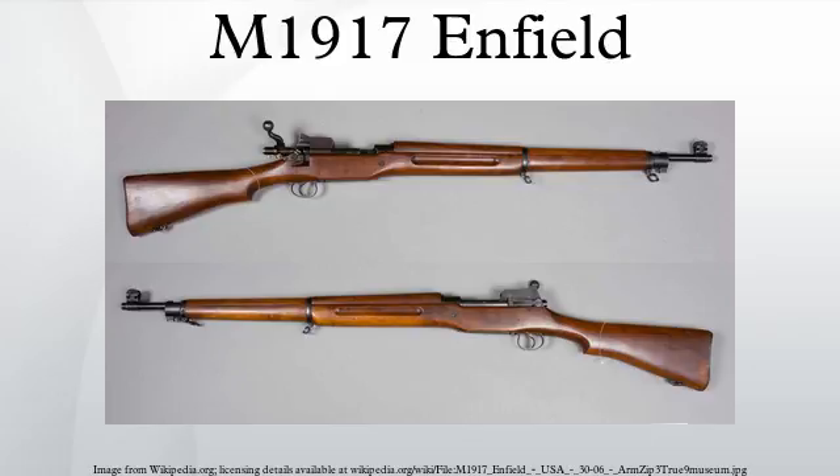Both P-14 and M-1917 rifles are noted for several design features. The rifle was designed with a rear receiver aperture sight protected by sturdy ears, a design that proved to be faster and more accurate than the typical mid-barrel sight offered by Mauser, Enfield, or the Buffington Battle Sight of the 1903 Springfield. Future American rifles such as the 1903 A3 Springfield, M1, and M1 Carbine would all use such receiver sights. The M-1917 sight was situated on an elongated receiver bridge, which added weight to the action as well as lengthening the bolt. The M-1917 action weighs 58 ounces versus 45 ounces for the 1903 Springfield. The rifle maintains the British cock-on-closing feature, in which the bolt's main spring is loaded and the rifle cocked as part of the return stroke of the bolt, which aided rapid fire, especially as the action heated up. Most bolt-action designs after the Mauser 98 cocked as part of the opening stroke.